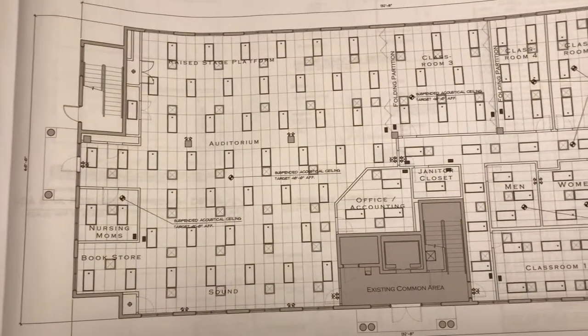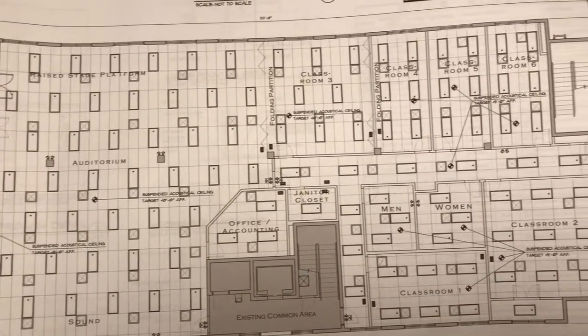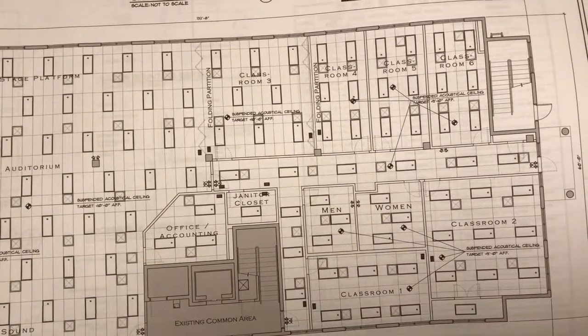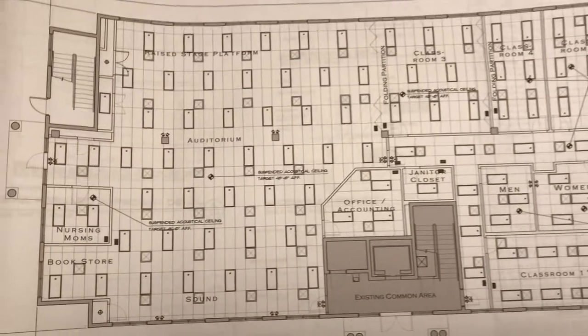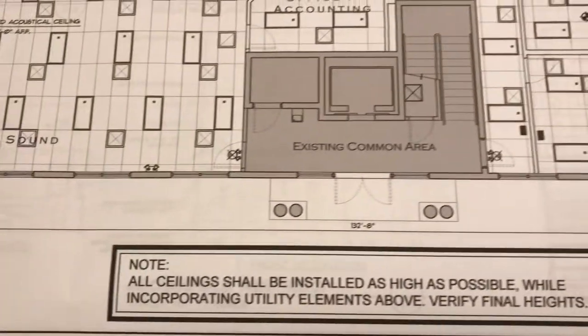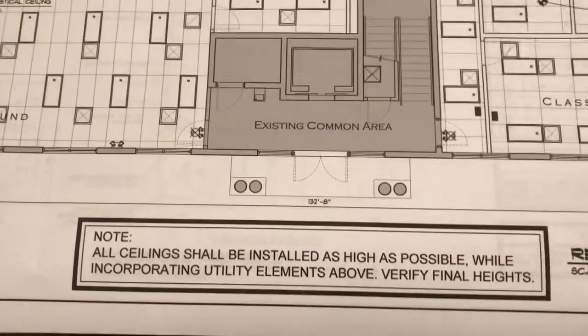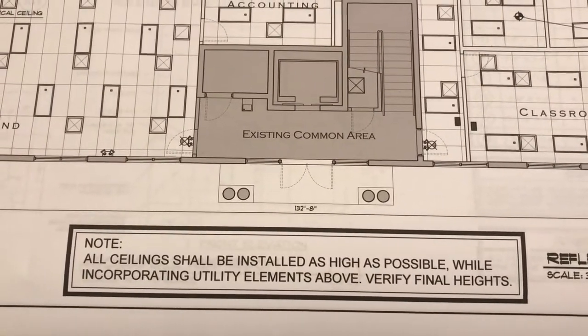Also, you have to look at the ceiling to find out what the ceiling heights are, because you have to put in draft stops, which you saw the detail on the plan, and you know where they would run or how high the studs have to go. All right. Review all the notes. Get yourself very familiar, then start your layout.